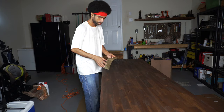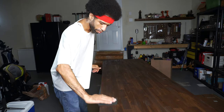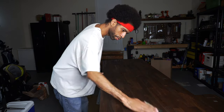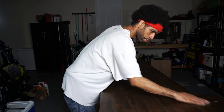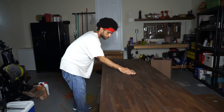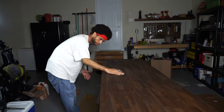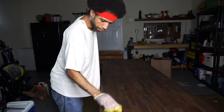Once the polyurethane dried, I lightly sanded the surface with 400 grit sandpaper. Don't use the pour technique shown by this man in the video. When you decide to sand, start at one end of the table and in one long stroke sand from one end to the other end lightly. You want to simply smooth out the surface, not sand all the gloss away. After I sanded, I used a tack cloth to remove the dust.